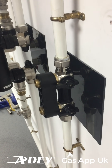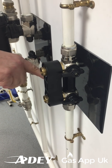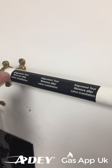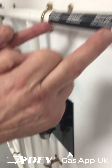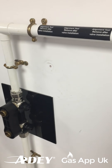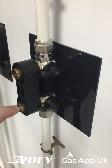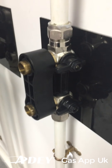We don't want any resistance - we want it to slip on and off so the filter's going to go on nice. Also, this alignment tool comes with the filter. And when it comes with the filter, you'll probably find also you will have this tape here. That's not just a decorative tape in the box. This is so easy and so handy to have - this is just wrapped round here when it comes out of the box. This gap here is 150 mil. Guess what? That's the 150 mil we need to cut out of our pipe work for when we're installing our filter. So this in effect is a template for our pipe work. If we take this out and stick it onto the pipe, this is going to tell us 150 mil in the absence of a tape measure. So when we cut it, we know that this has done exactly what this job is going to do.